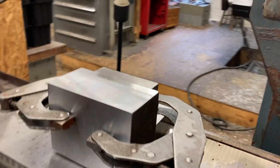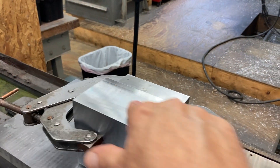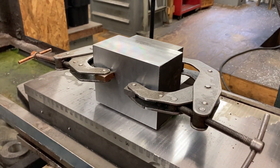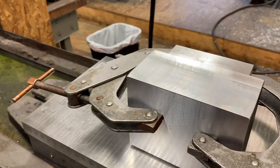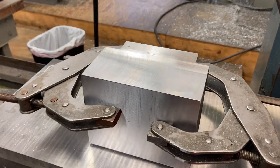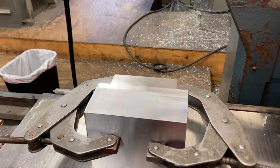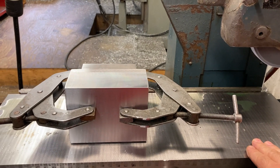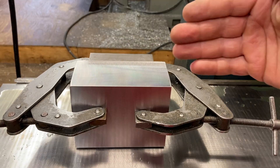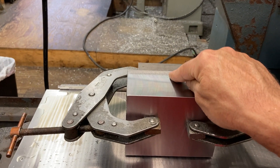We clamp our block to the knee with the clamps. When we grind this top surface, it will be square to these two surfaces. There's about eight thousandths to come off in total, so we'll take about four thousandths on this side. I already touched it to make sure the block isn't tipped — you don't want to be taking nothing over here and ten thousandths over there. I have a surface gauge but there's no real estate and the arm isn't long enough to get over the piece, so I can't check it that way.